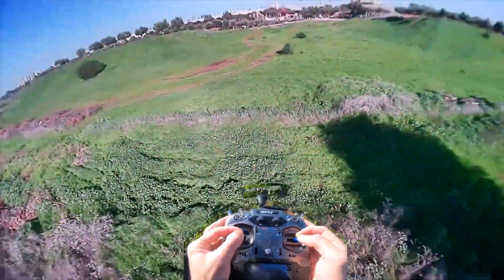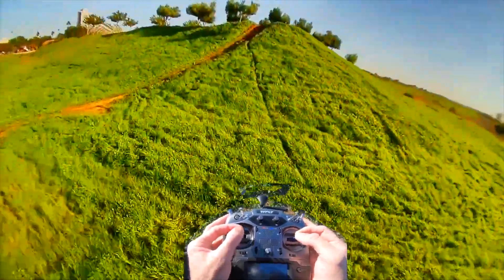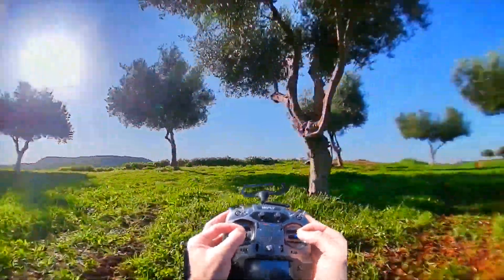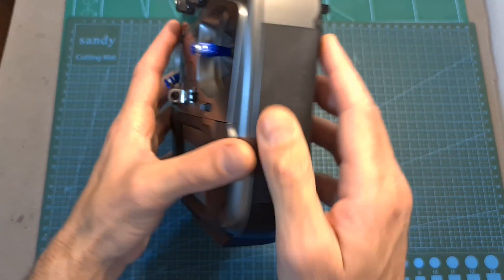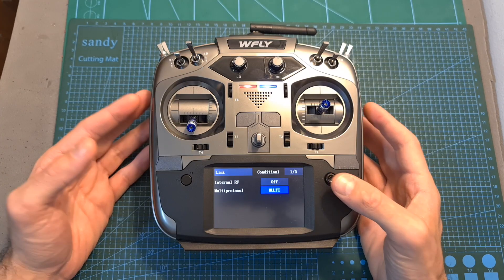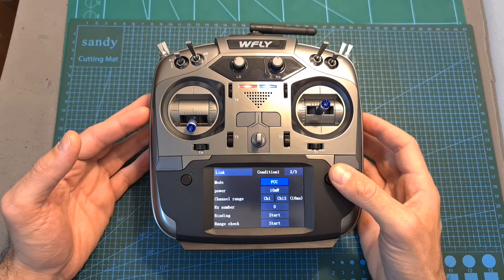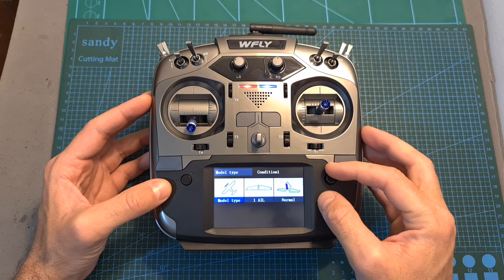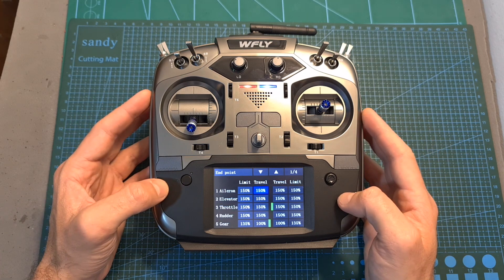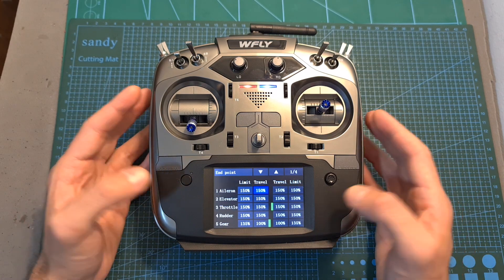After testing it out, even though this is a high-quality and very comfortable radio controller, in my opinion it is not a good option for quadcopter users — mainly because it is not using OpenTX. For example, if you plan to use an external radio module such as Crossfire, you won't be able to configure it; currently the only supported options for configuring external modules through the controller's interface are multi-protocol and R9 models. Also, as you can see under model types, there is no multi-rotor option, so you will need to manually adjust the stick settings, which might not be a deal breaker but is not very beginner-friendly.